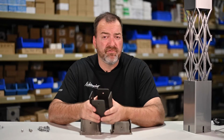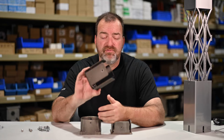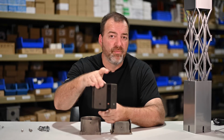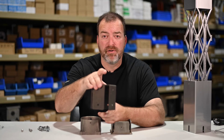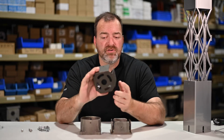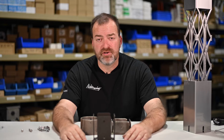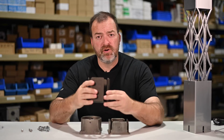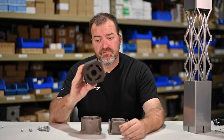So in the past, if you've ever installed any of our bollards or path lights, you've noticed this universal mounting bracket that we've used. You can use it this side for putting on top of a PVC pipe for a stake, or you can use it simply as mounting down on a solid surface or a pier and secure it that way. If you look at the difference between these two, you'll notice that this is a bent steel version.